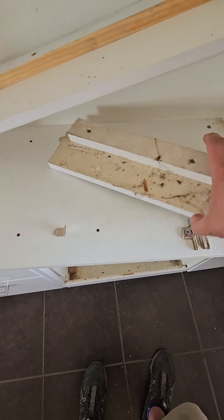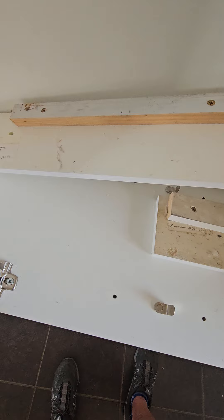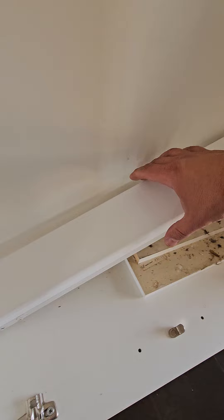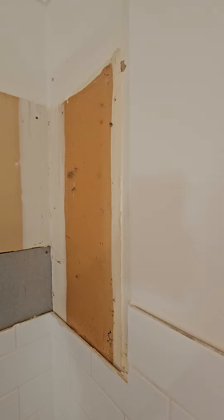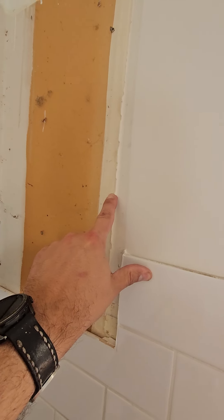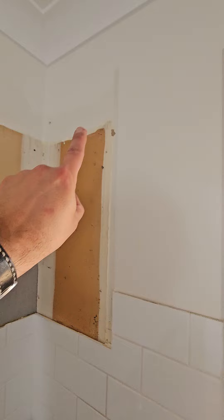You're just at the mercy of whatever, and there's also cheap, shoddy installation here with the filler — just not scribed at all. It was placed up against the wall with a bit of no-more-gaps, and you could clearly see the gap. The front of the filler was here, but the no-more-gaps is back there — they actually applied no-more-gaps to the cupboard, not the filler.